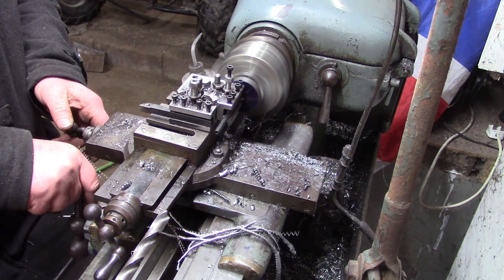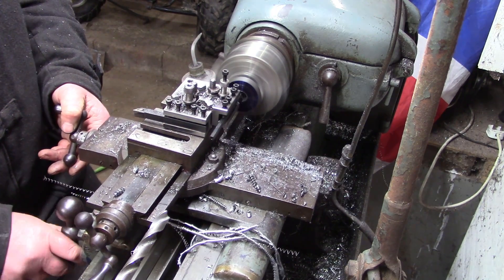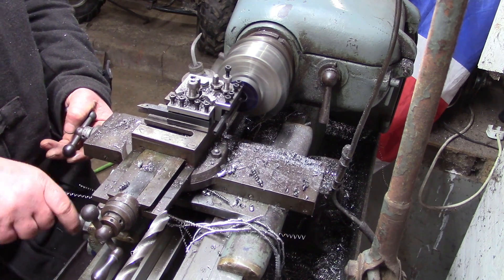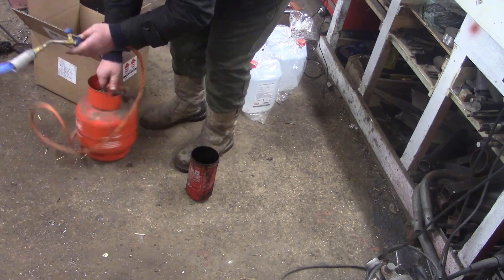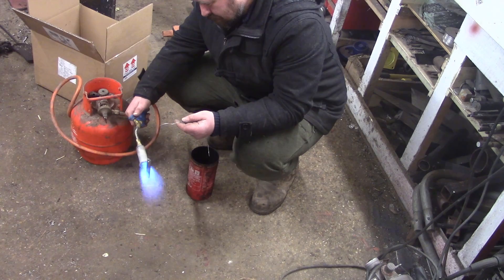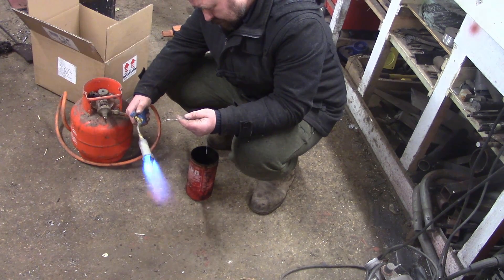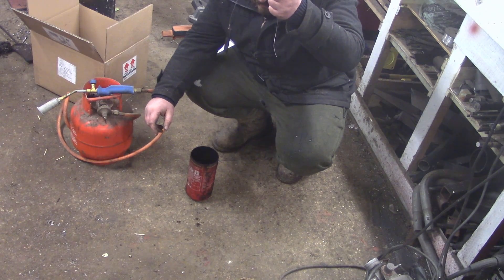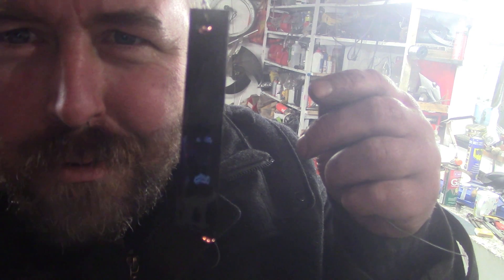I'm just finalising that ball cut, but I'm not cutting all the way to the end — you'll see why in a minute. Now I'm just hardening the cutting tool for cutting the spline. That was a brand new clean ATF I just quenched it in. You can't really see it too well — it's hardly stained the steel.